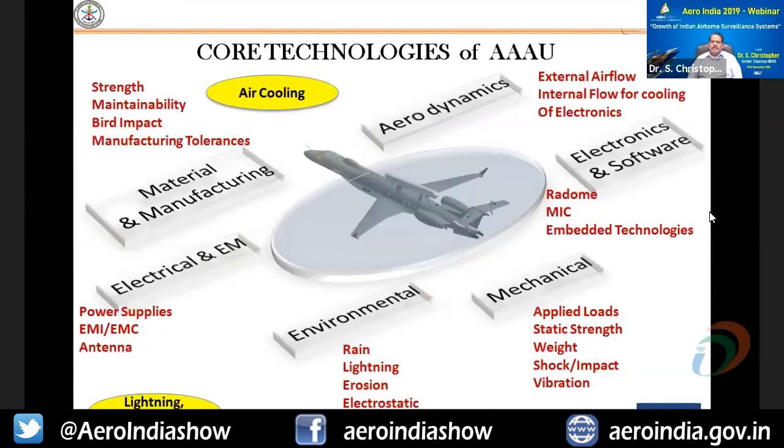Having done this aircraft modification, interior and exterior, the major component, which is probably very critical in this system, is the AAAU, or none other than the active antenna array unit, which goes externally. Unlike any other conventional radar antenna, where enough energy would have been spent on designing the antenna per se for its performance as a pattern or a side lobe, or for that matter gain, in this case yet another dimension has to be looked into.